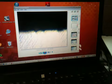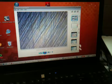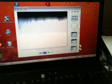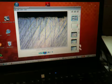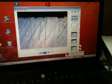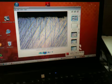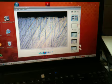Okay, and here is the scratch pattern left from your stone on the edge there. Let me just, okay, that's about right. And I'll focus. So what we have here is your stone brightened up. I'll take a photo of that. Your stone brightened up the blade quite a bit, and it began to remove those 45-degree scratches left from the King 1000.